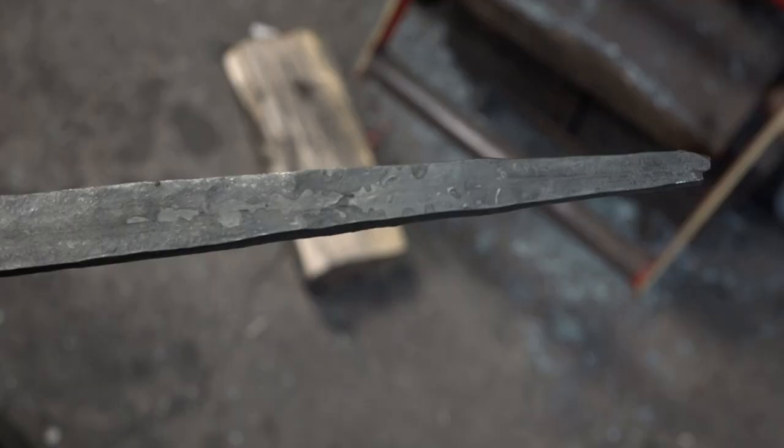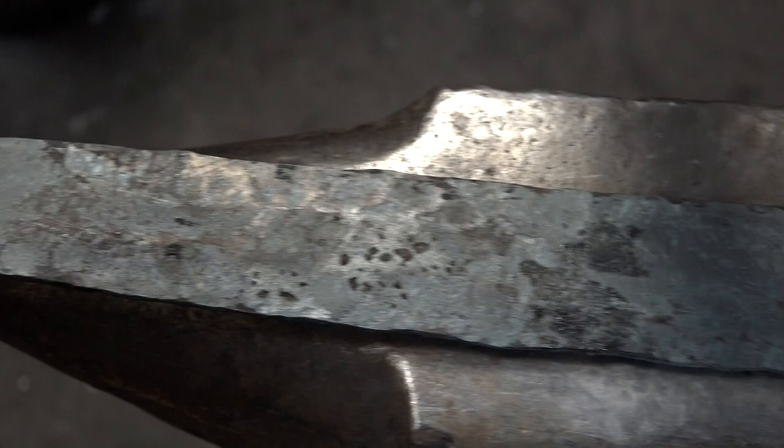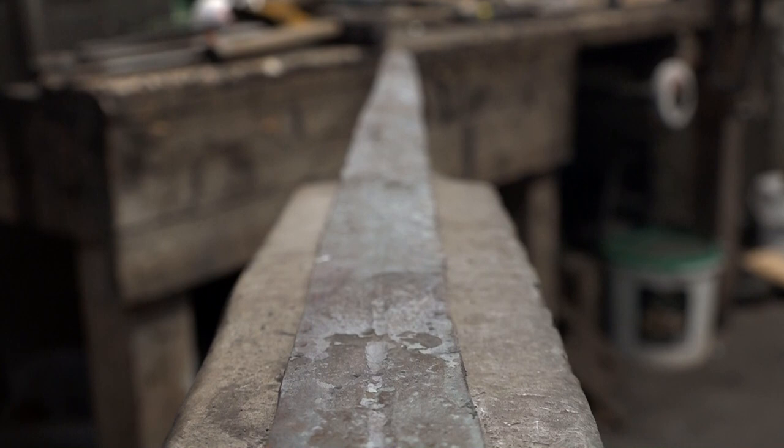I inspected the result of the first day's work. In that day, I had been taught how to use a forge and a power hammer, had made a nail, and then had shaped out the sword, tapered it in both directions, added the beginnings of a fuller, and had added most of the bevelling. I was not impressed with my fullering prowess, but Thom assured me that it was good enough and could be sorted out in the grinding stage.